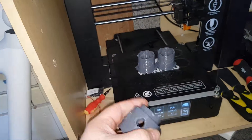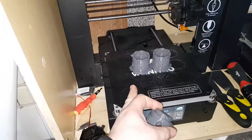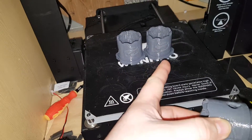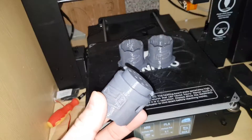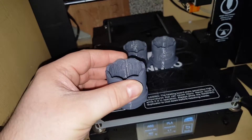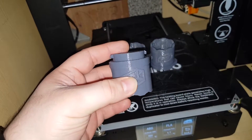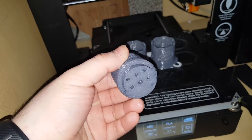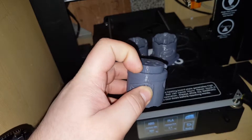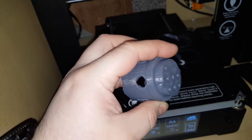Of course, because it's a 3D printer, plastic just drops out the end of the nozzle and hopefully lands on the bed. So as you can see here, there's a part around these two that is not around this. That's because the best way to build this part is upwards like this, as opposed to building it like that. It's a lot easier this way because you've got a fully flat surface there, so it sticks to the bed really well. But unfortunately, there's this huge lip around the edge here that is an overhang.